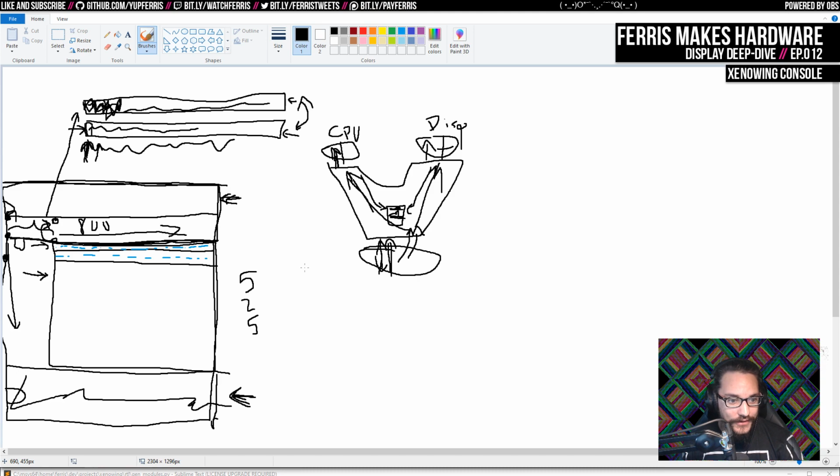It has these character accesses. Okay, then yeah, the front porch is at the end of the line before H-sync, which in this case, because our H-sync is here, then this is our front porch, this is the H-sync, and then this is our back porch. So it's actually this entire period, which is, I think, the horizontal blanking period. It ends up reading all the data until about here. And again, we could read all the data until out here if we wanted to, as long as we have all the words loaded before we actually start displaying them. So this should be just fine.